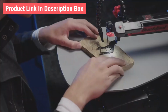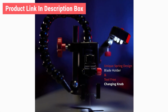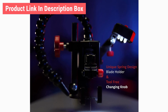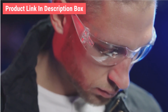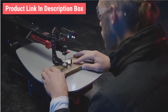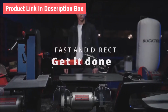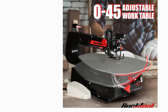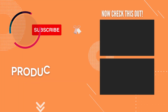But what you'll like most about the Bucktool Scroll Saw, if you're a toy maker, is its smooth, quiet, and very low vibration performance, which makes it ideal for small, detailed projects that require concentration. This scroll saw has a 16-inch throat and can cut to a maximum thickness of 2 inches. Its variable speed control ranges from 550 to 1600 SPM. The tool has a work light and onboard blower to keep debris away from your cut line. You can use either pinned or pinless blades, and no tools are required to change them.